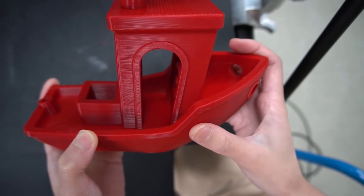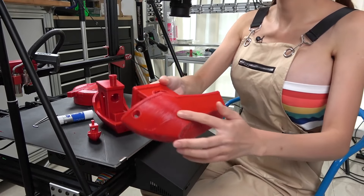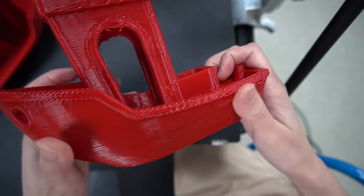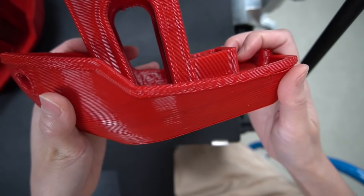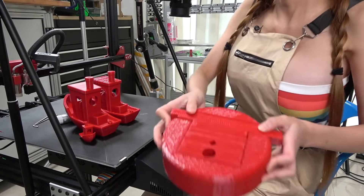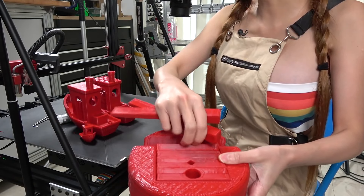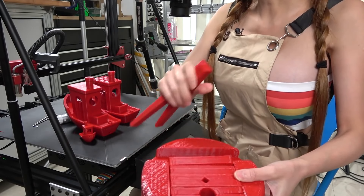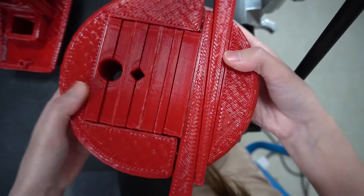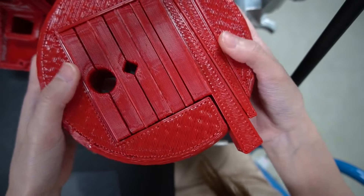But if we look at the prints I did with a 1mm nozzle at 0.8mm layer height, this took just 4 hours — the same amount of plastic, 300g — with almost the exact same tolerance and same strength. Here's a small work-holding vise, 100% 3D printed. It's based on a traditional Chinese design used for carving stamps — I'll put the STL in the description. It took 7 hours to print, weighs 700g, and the same basic design could be used on a small CNC machine and customized to hold any irregular shape.